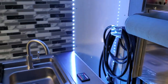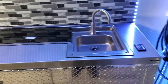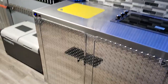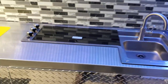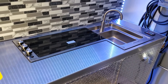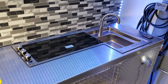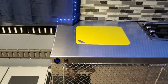Now I'm going to show you the sink and stove unit — this is the part I'm probably the most proud of because it took a lot of work. This is another Pit Posse race trailer cabinet. It's a six-foot cabinet, about 42 inches tall, and super nice quality. The nerve-wracking part was having to cut a hole in the top — you don't get too many chances at getting that right. So I made a template, cut the hole, and then did some reinforcing on the underside with bracing to make sure it will support the sink, stove, and anything you put on top. It turned out really super nice.